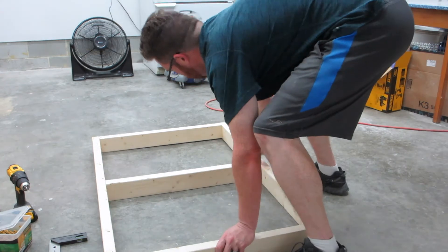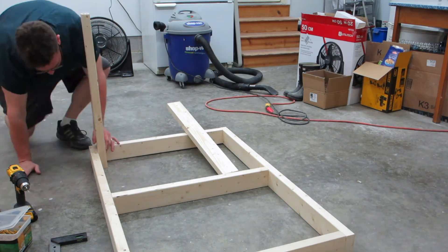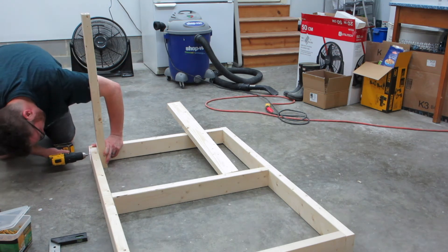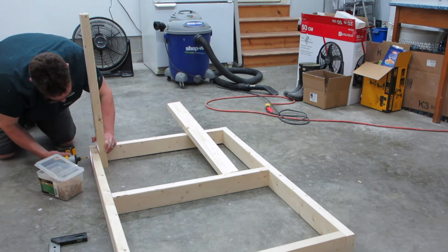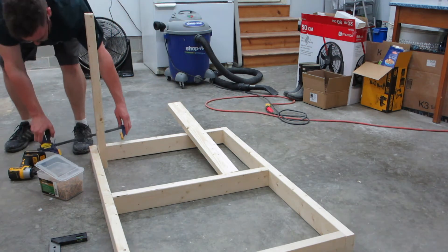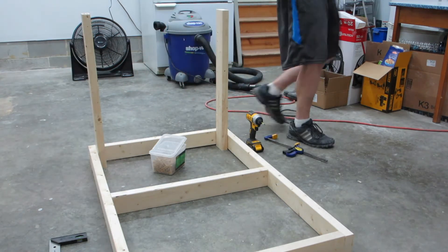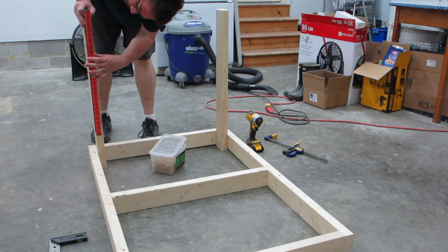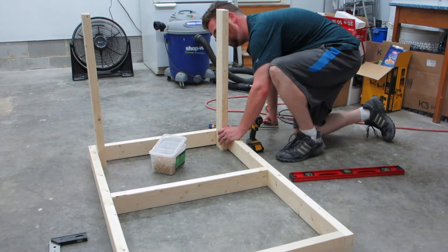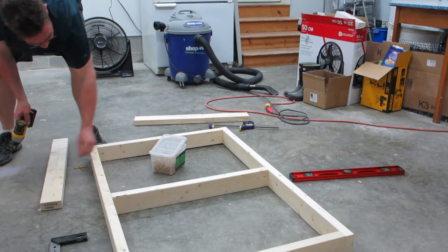It's racked, twisted, warped — I don't know, it's just not right. Another tip: when you're trying to do even a butt joint and you want to screw through to that second piece of wood, it's going to move around a whole lot, so it's a lot easier to do it with clamps. At this point I start to think I'm pushing forward a little too quickly, so I checked level on the first one and then I really don't like how this is twisted — so let's undo that.